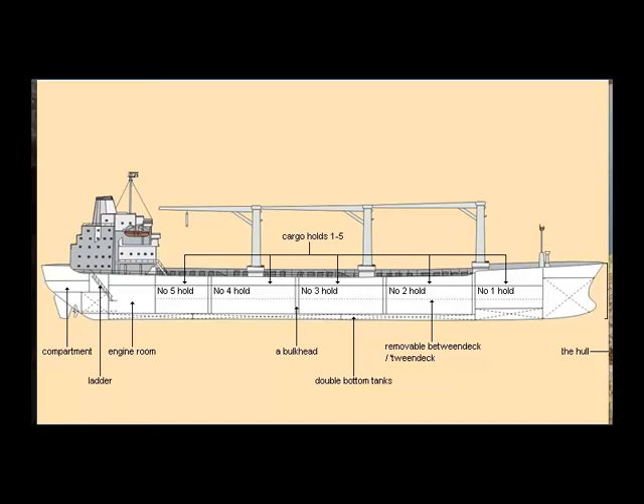The marina makes a speed of 17 knots. She carries a crew of 15. Her deadweight tonnage is 12,000 tons. Her overall length, LOA, is 140 meters. Her length between perpendiculars, LBP, is 130 meters. Her breadth is 22 meters, and her draft is 7.5 meters. She can carry 521 twenty-foot equivalent unit containers, including 20 refrigerated containers. The total cargo hold capacity is 14,950 cubic meters.